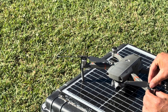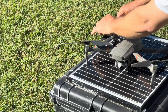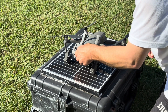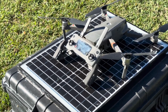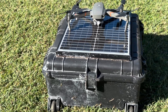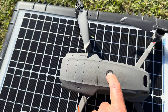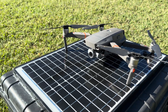I contacted qualified electricians and they couldn't even help me assemble the solar device, so I had to learn it all myself — I went online and learned what the different components were. Solar is all about balancing the system: you want to make sure the panel size is suitable to your battery size, that your charge controller is relative to both the panel and battery, and that your inverter is sized for the power you want to draw.